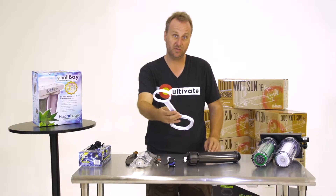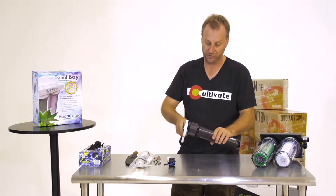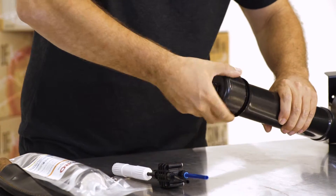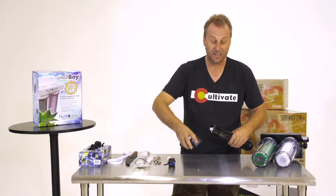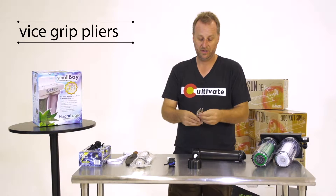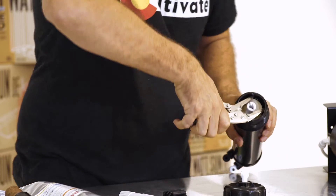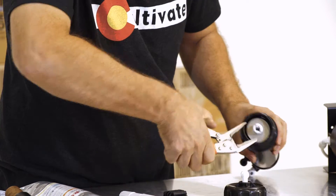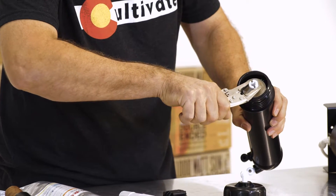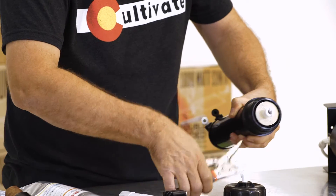Now at this point, you take your handy filter wrench that came with your hydrologic filter. Just take the top off, it just screws right off. Now that's when you're going to need your handy dandy tool box. I'm going to break out my favorite tool — vice grips. You're just going to want to barely clamp on this, just get it the right size. Barely clamp on it and turn it in a clockwise manner and pull up a little bit and leverage it out of there.